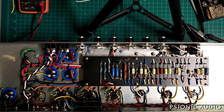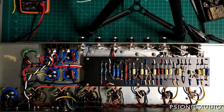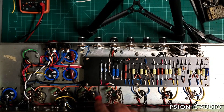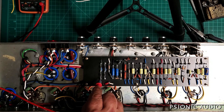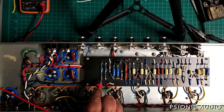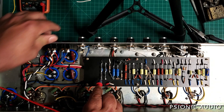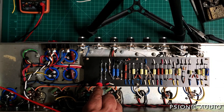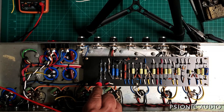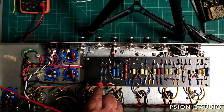At this point there is no DC present in the amp, because the standby is done by interrupting the HT secondaries going to the rectifier. I've got a voltage limiter, and I'm measuring DC at the positive output of the rectifier bridge. Taking it out of standby now — it's going from 0.008 volts, the caps are charging up: 465, 467, still climbing.